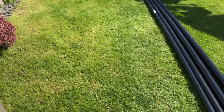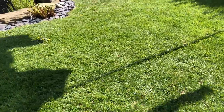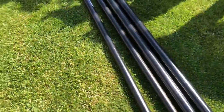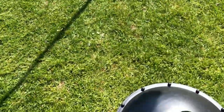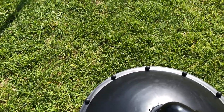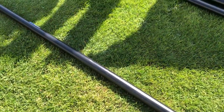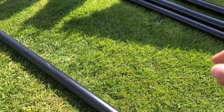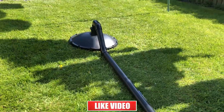a piece of pipe, or we could take it over and offer it up to the end and see what it'll look like. Pop it down on the lawn. Piece of pipe in, then we can run that across the bottom of the pond. Can be brought up and out along the bottom length of the pond from the centre, elbow up from here, somewhere like that, I would have thought, elbow up and away to the filter system then. So that's that bit ready to go, ready to be glued in.